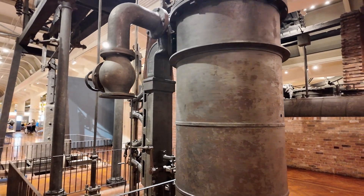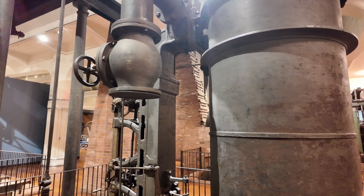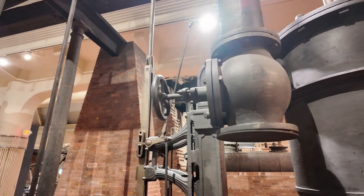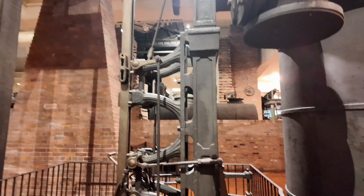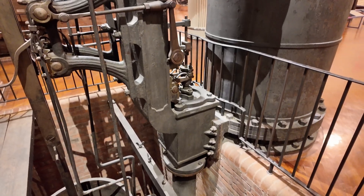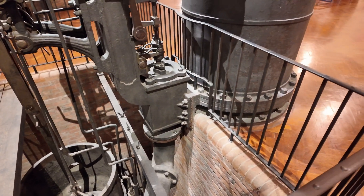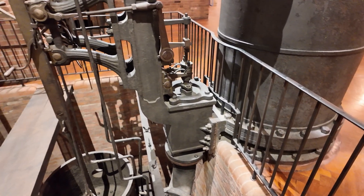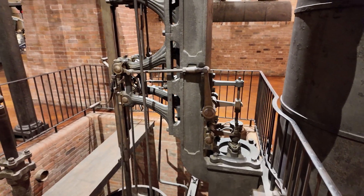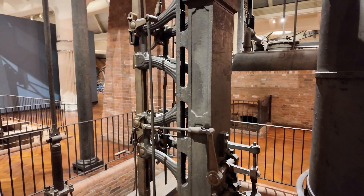This pipe coming down on the left is the steam inlet, and it goes up to the manifold at the top. The manifold connects both top and bottom, because unlike the previous canal pump from James Watt, this one is actually a double-acting cylinder and includes most of the newer innovations which he later created in various other engines.